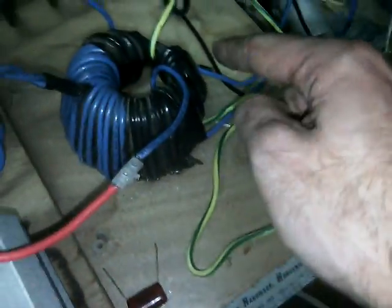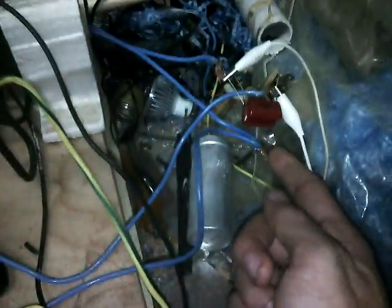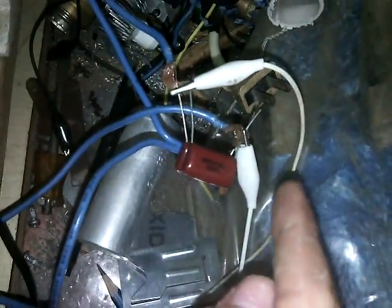That's why sometimes you'll see Rosnan adding some capacitors — more capacitors in the rewind area. So it's bifilar going in series — rewind, in the bifilar. You get the point. And the two 28-winds: there's one as output and the other one is just straight connected. One 28-wind is connected straight in series with the Grenade, and one of them coming out is as output. And one from the 28 is as output — two wires over there, coming straight. And that's the magic of the push-pull.